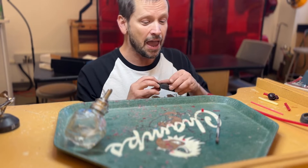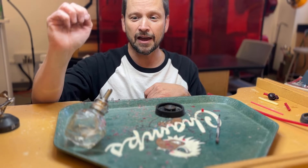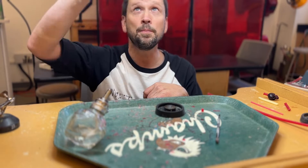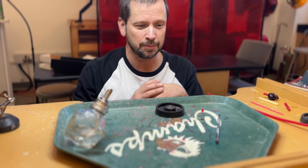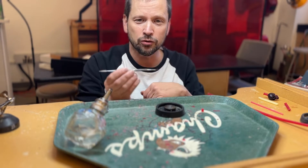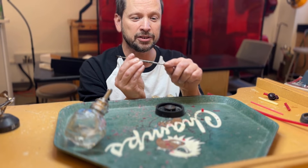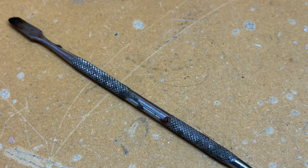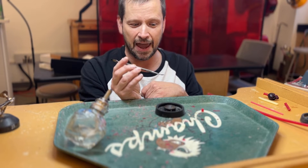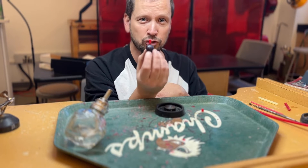Make sure you have that smoothed in. I've also set up an alcohol lamp — be very careful with alcohol lamps because the denatured alcohol flame is almost invisible, particularly under a desk lamp, so it can be very hot. The most basic tool I like to use for sprueing has two different ends; particularly the angled end with a small spatula paddle, which is useful for getting into areas that might be tricky to angle into.